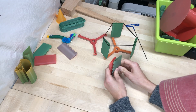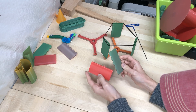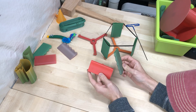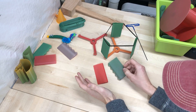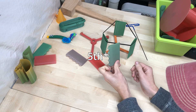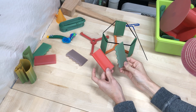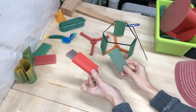It does appear that the lumps don't impact power output in a positive way — we're again seeing an output loss of over 50%. So right now, probably don't put them on your turbine blades, at least not in this version. Let's see how this changes the leaderboard. In second place, nearly first, is Robert's airfoil without the tubercles. In third place is the exploding turbine. In fourth place is the lumpy airfoil, and also in fourth place is Robert's tubercle airfoil. To recap, we're seeing a 50% or more decrease in power output with the lumpy blades versus their non-lumpy version.